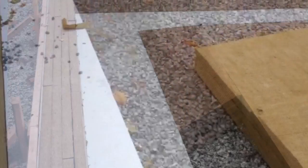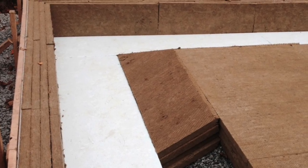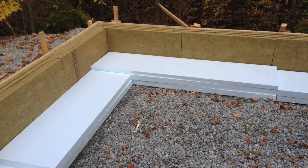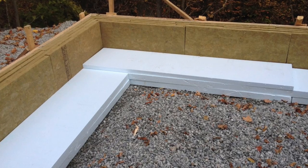Welcome to episode two of the building guide. If you saw the first one, you'd know that our under slab is prepped with plumbing. Now we're laying down insulation. We've got eight inches of insulation on all surfaces — Roxul comfort board on the exterior and under the main slab. Since comfort board hasn't been tested yet for the added weight of a footing and load bearing wall, Roxul engineers suggest using EPS foam under the footing just to be safe.